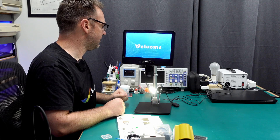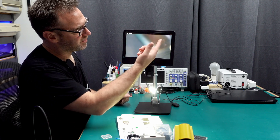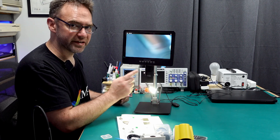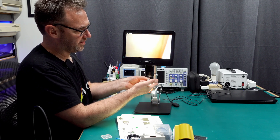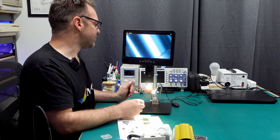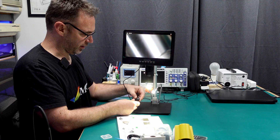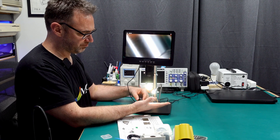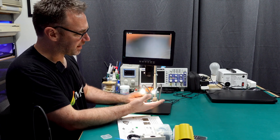It looks to be alive. Got a welcome screen, and there's a time display and a Wi-Fi indicator. Obviously everything is going to be very out of focus — I think this lens is the short distance lens, so I have to get up pretty close and then get some light. There we go, that's part of my finger. It's drawing about 1.1 amps at 5 volts. Let's bring up the brightness — I think that's the LEDs at full brightness, which seem decent. It's drawing about 1.4 to 1.5 amps at maximum brightness.